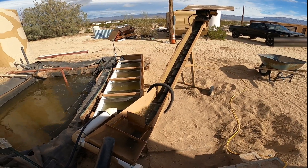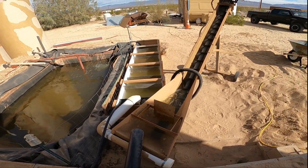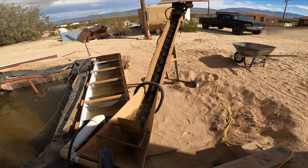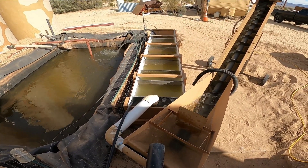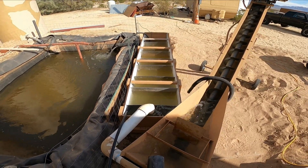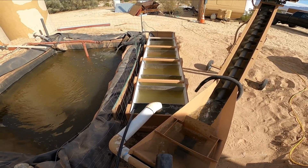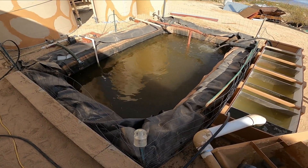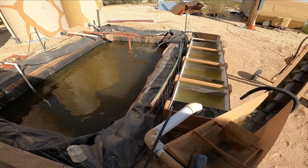So water enters the descending screw. Sand will be separated and dropped out there either into a bulk bag or for a piece of heavy equipment to move. We'll have our slimes flume here capturing a large quantity of slimes. We need to do some testing to find out how much per tonnage and water flow. There's our pond, a 2,000 gallon pond. The slimes flume holds about 334 gallons of water.